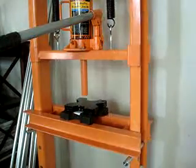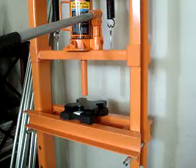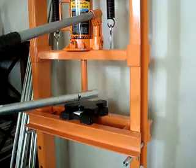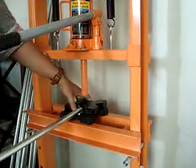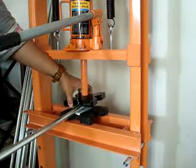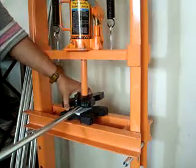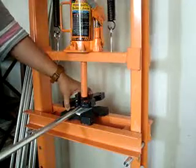I'm going to be doing another demo here on flattening the ends of each conduit, like so. Just one side is flattened already, and I'm going to show you how to flatten the other side. Since I don't have a jig like most dome builders, I had to mark my conduit at one and three-fourths of an inch from the edge.